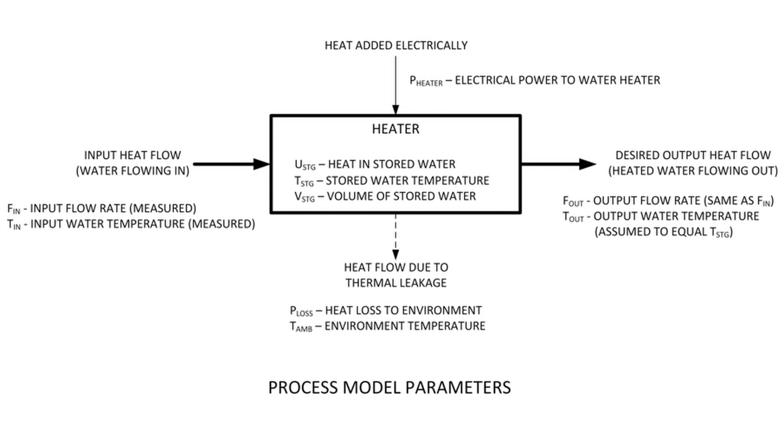A calculation is performed in real-time to decide how much heat must be added to achieve a specific temperature setpoint at the outlet. This calculation is built on a mathematical model considering heat transfer and other factors, rather than a simple feedback temperature loop, giving it the ability to react proactively to changing input conditions rather than waiting for changing output conditions like a traditional temperature loop controller.